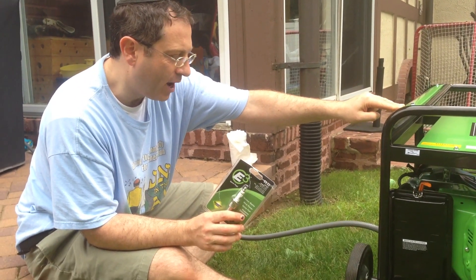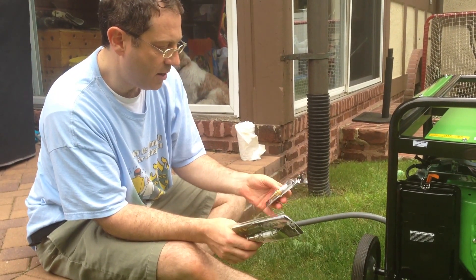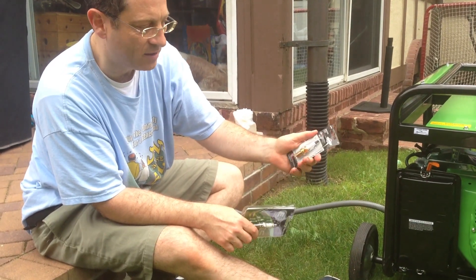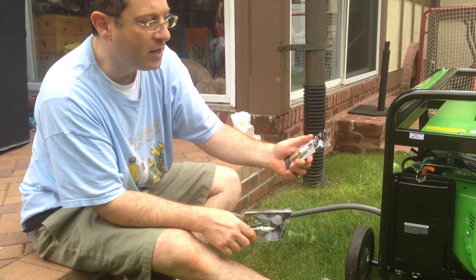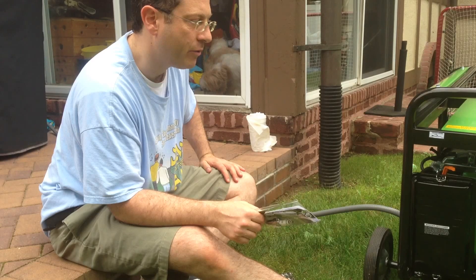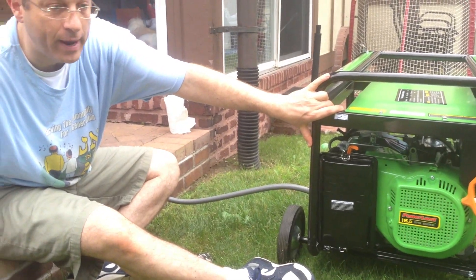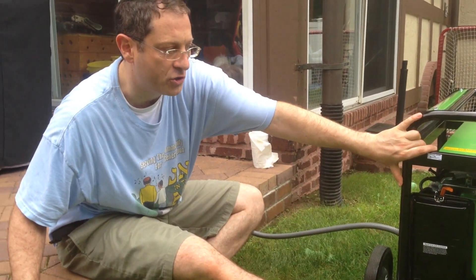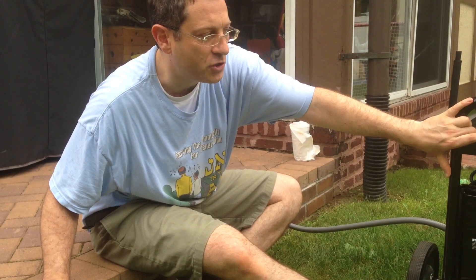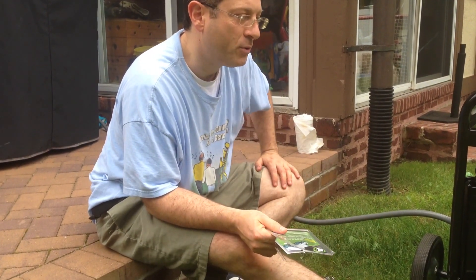You don't always need this. What I usually do on my generators — my 20 kilowatt and my portable with electric start — is put in the Briggs & Stratton platinum spark plug. That provides better sparks, but I don't think it would completely take care of this problem. This generator, although it has electric start, doesn't charge the battery and doesn't come with a battery charger. The only way to charge it is to hook up a trickle charger. The owner isn't that familiar with generators, so we really want to make sure we can start it on a pull start.